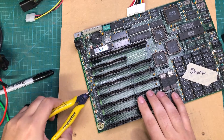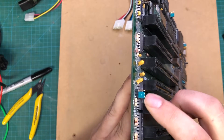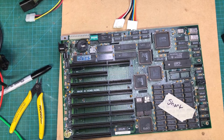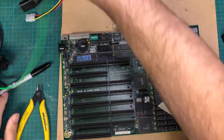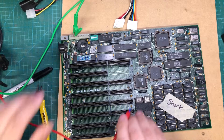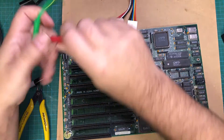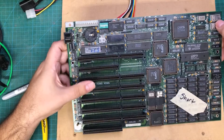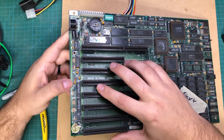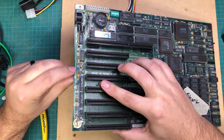I've got the beep, so now I know that capacitor is shorted. What you do to start with is take your little side cutters like this, cut it, and lift — you can see where I lifted one side of that capacitor right there. Then you go back and do the exact same test. I'll clip one onto the negative 12 volt line — I've got no connection and no short. From experience I can tell you that when I power this thing up, this motherboard will actually boot. It was this capacitor preventing it.